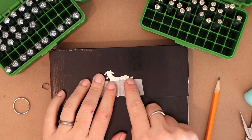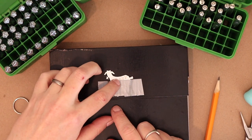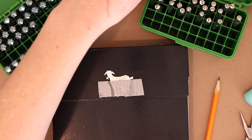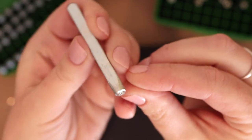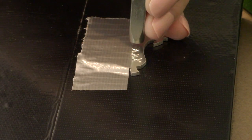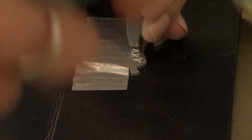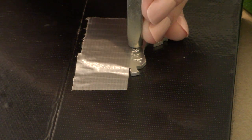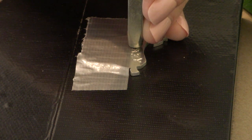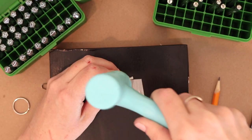So what I'm gonna do now, since that Y is weird, I'm going to adapt my design, and CR, I'm gonna make them all weird. So R, make sure I have the right stamp, make sure it's facing the right way. I'm gonna go ahead and slide this down till it touches the tape and make sure that my spacing is good. Make sure my stamp is up straight and that the bottom side of this stamp here is parallel with the bottom of the blank.